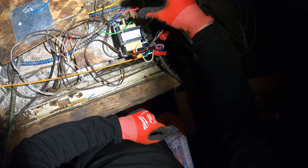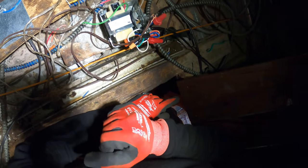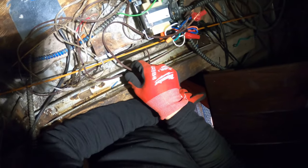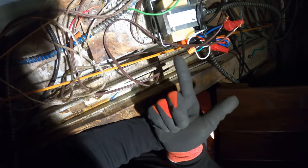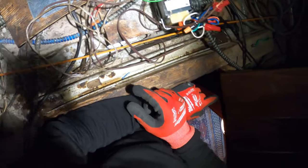I just figured it out. I disconnected all the wires leading up to the two units, and it trips while it's not even connected to any of the units — so that's telling me there's a short somewhere in these lines from here up to the units. As far as the units themselves, they could have issues as well, but I cannot know until I get my 24 volts over there. So the issue is from here to those units. Hopefully I can see something, but if not, I'm going to say these lines have to be replaced.